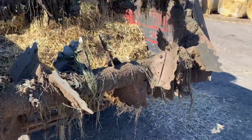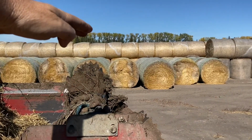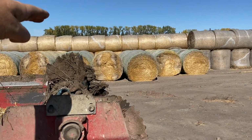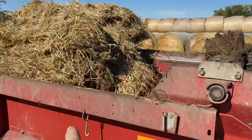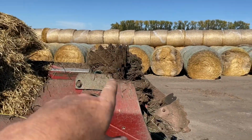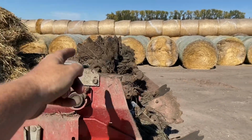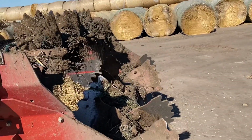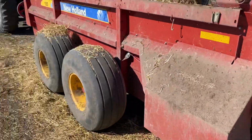So the conveyor belt's there, and then you build out of, it can be out of anything. It can be out of wood, tin I would imagine be best, and you build a canopy that comes down like this, and you set this on high speed floor, and then you try and RPM down for the beaters, because they don't need to be going that fast. So yeah, the silage comes up, the beaters sort of break it up into nice loose digestible, picks up all the lumps, drops it onto the canvas and out the side, and you feed it.